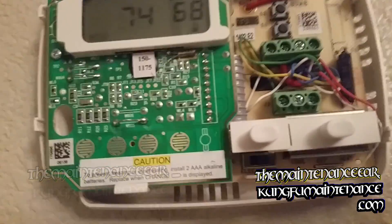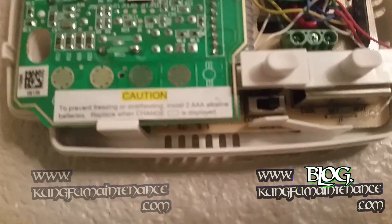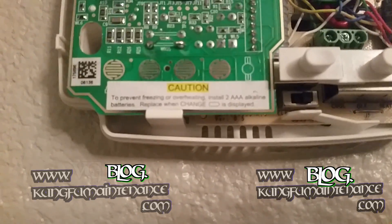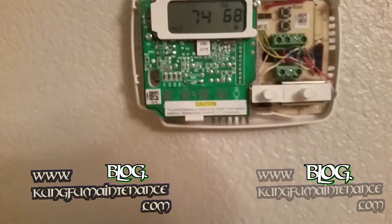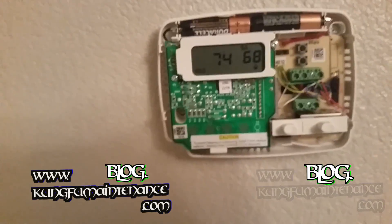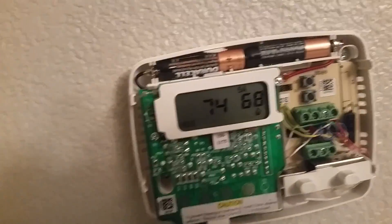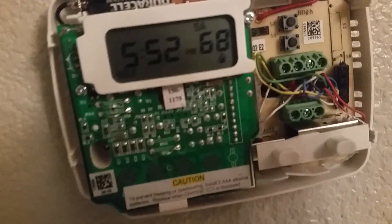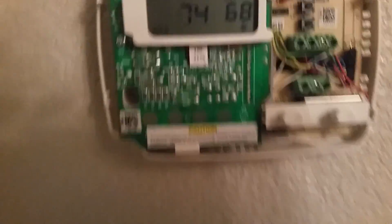This one has a little switch down here — right is for gas heating and left is for electric heating. That particular one was set for electric heating, which is common to all of my other hydronic units. So it wasn't that, but again it was the insulation that was blocking so that the wire wasn't making contact on the RH wire.